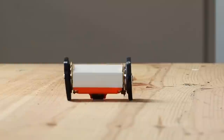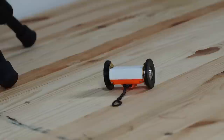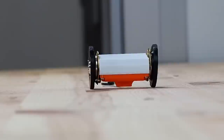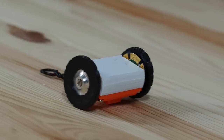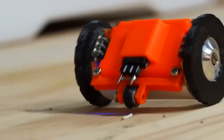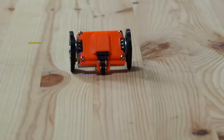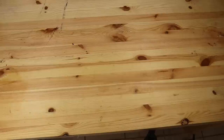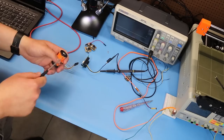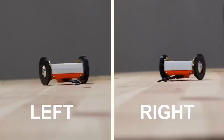As you can see, the connector is sometimes sitting on the ground, which makes it act like a little tail helping the robot not to overturn. But the robot's body is still shaking, so a better idea is to use a longer, heavier tail, which makes it much more stable. Another approach is to use a third wheel, which also worked very well, although sometimes the third wheel was bouncing when trying to turn. In my opinion the tail worked better because it was heavier and also means one less extra bearing.